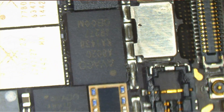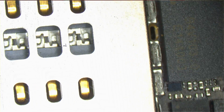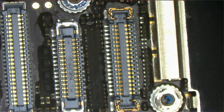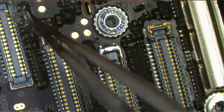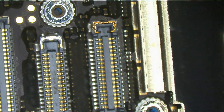But there's no corrosion here. So let's see if you can tell me what is wrong with this — see if the viewers can guess. I'm just going to scroll through. Clean, clean, clean, clean, clean. A little dirty — a little bit of junk but that's on the underfill so we don't have to really care about this very much. We'll keep that in mind if something doesn't work in that area; that's the front camera I think. Not incredibly important at the moment since it's dead.